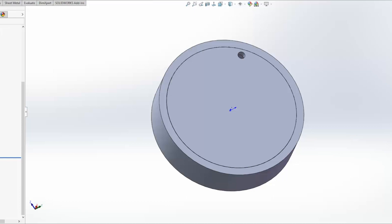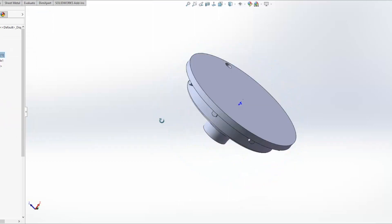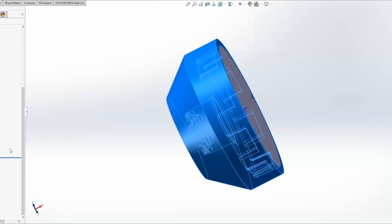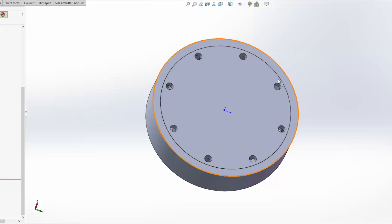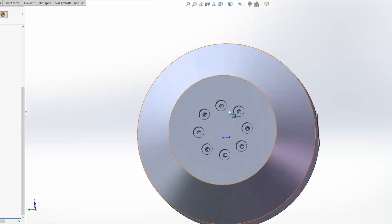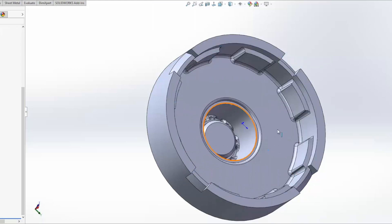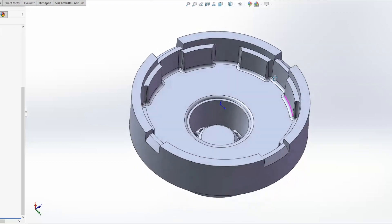At this point, we've separated it into two separate bodies — one that is the outside of the mold, the other that's the inside of the mold. We extend some features through for being able to attach bolts. Those are going to have threaded inserts in them. Some demolding features there and here on the underside for ejector pins. We hide the insert to the mold — you can see what we are working with.